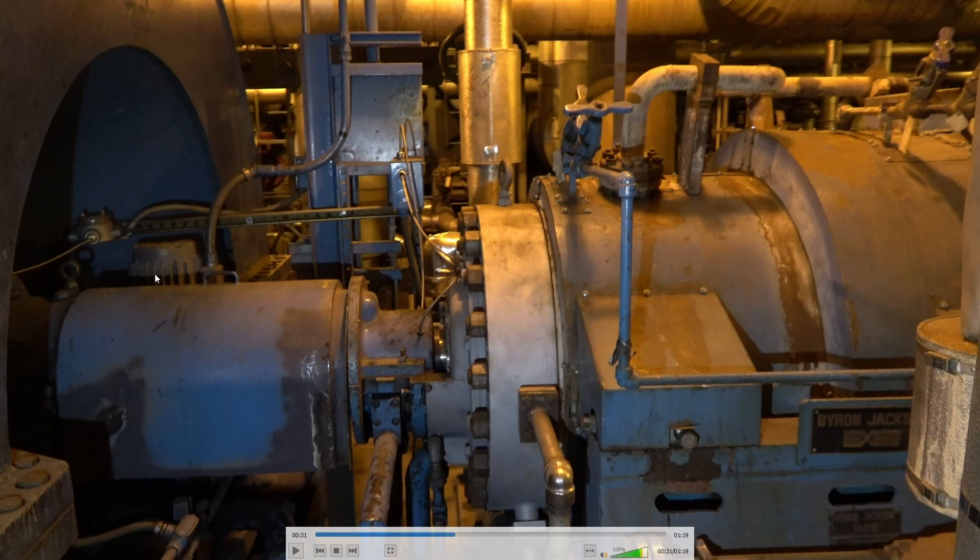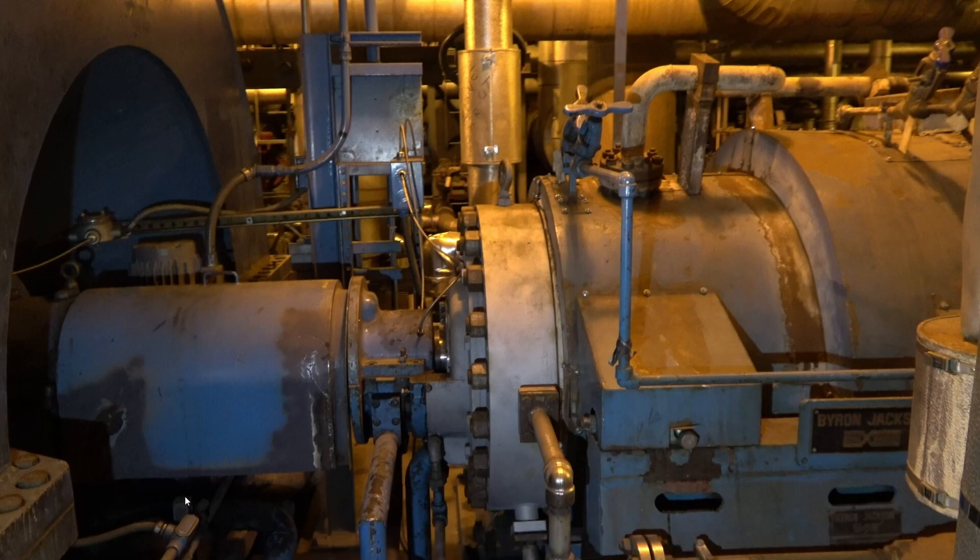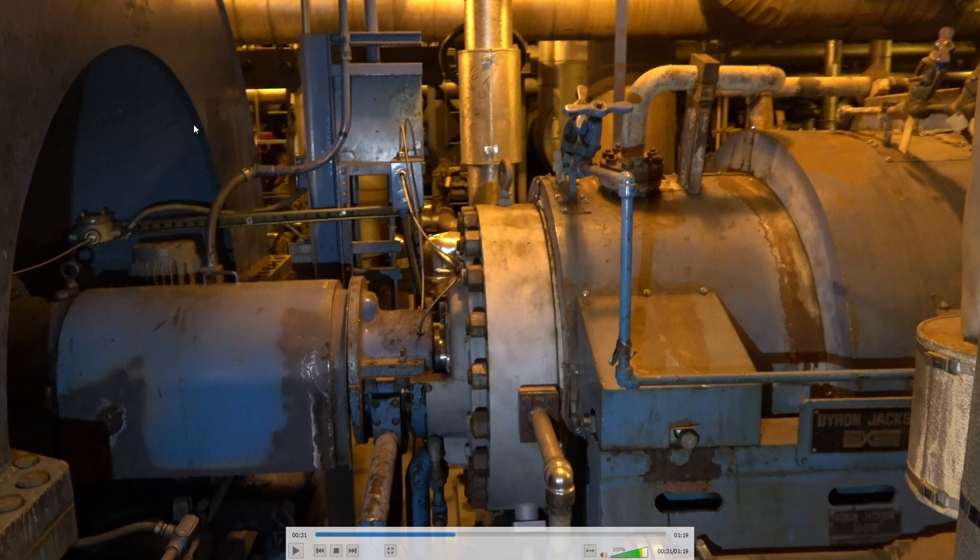Here's your turning gear — this is critical. When the pump shuts down it should auto-start to keep the shaft rolling real slow so you don't warp your turbine shaft; that allows it to cool uniformly. The turbine has steam seals on it; most of that sits underneath. It comes off the gland steam sealing system, same as your main turbine, and from here it goes down to the gland steam condenser where it's condensed along with the main steam turbine's gland steam.